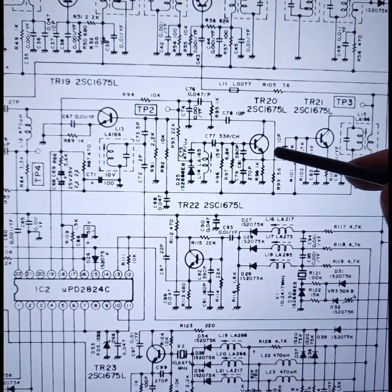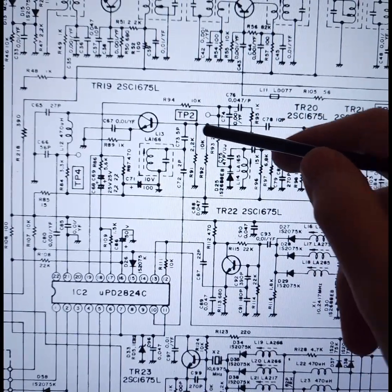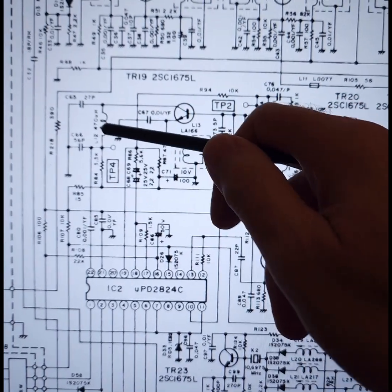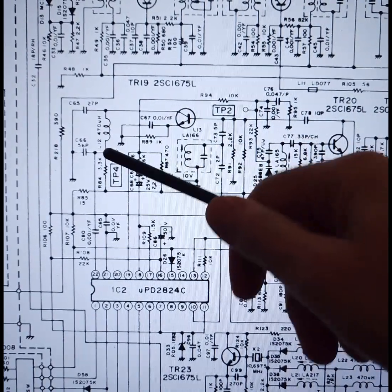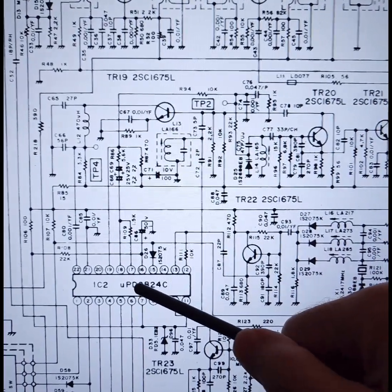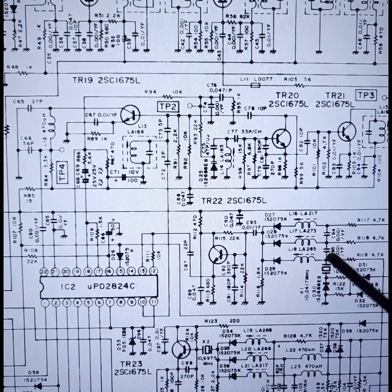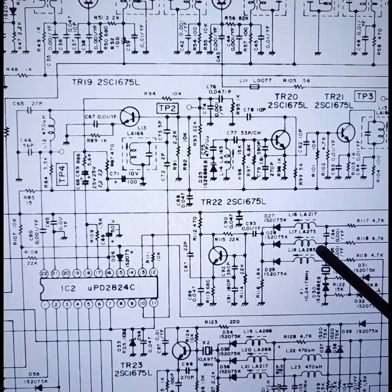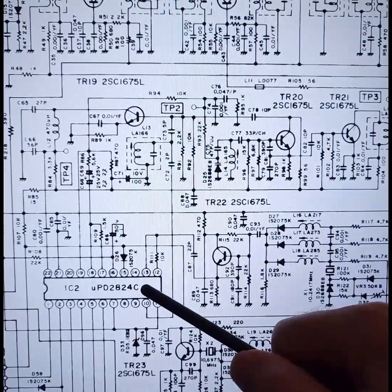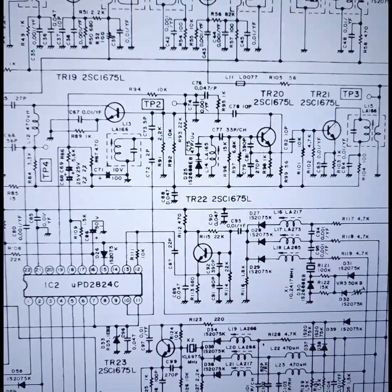This goes out to the radio here, but it also comes back this way to be monitored by the PLL chip. So I obviously got rid of this circuit. I've got 16 meg coming back in here, and then I just changed a couple of values here and got rid of this low pass filter, and basically I bring the 16 meg straight back into the PLL chip, and then I control that 16 meg directly with the PLL chip. And as I said, I still use this as an offset for the sideband, and for the clarifier as well. It still changes the reference frequency for the PLL, which obviously in turn ends up changing the local 16 meg oscillator. All right, that's it. See you later.